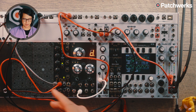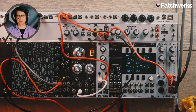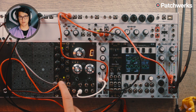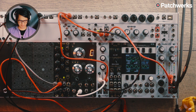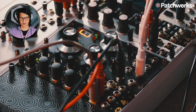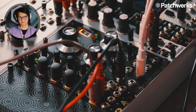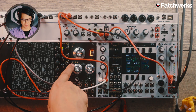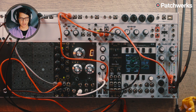The FM input here is really cool. Before we go into that, I'll show you that when I play a note it will just hold on to that note — it's an oscillator, it's droning, but it's being gated behind our DVCA here which is being triggered by the Rainier. I'll play some octaves: low C, up an octave. I can already see that this is tracking very well over four octaves. I can't tell you how many oscillators I've played with where I'll keep it in a three-octave range because even though it says it can track, it may fall out of tune. Another great feature: the tracking trimmer is accessible on the front panel, so you can use a little screwdriver and manually calibrate your oscillator without pulling it out of the rack.